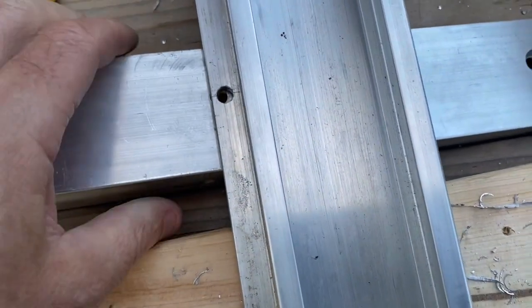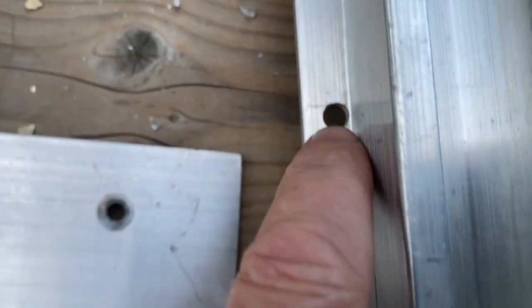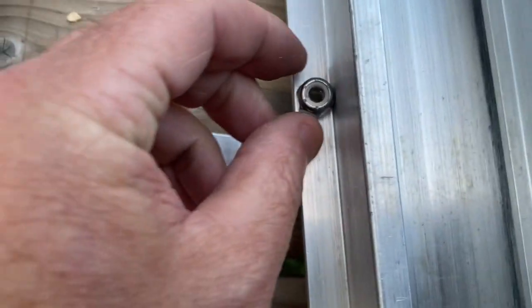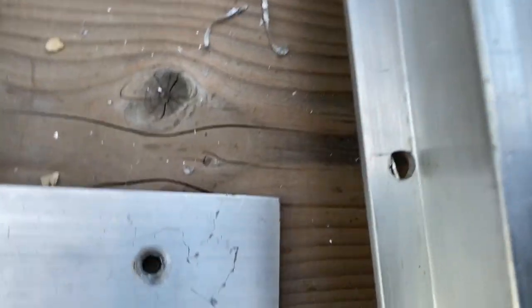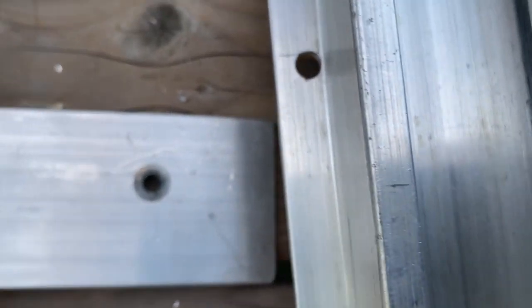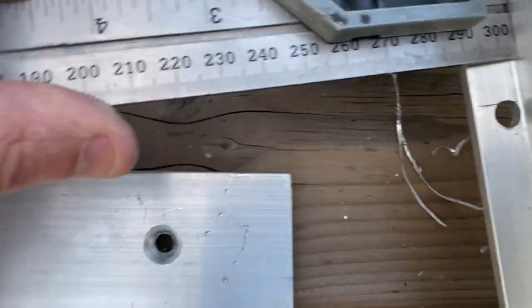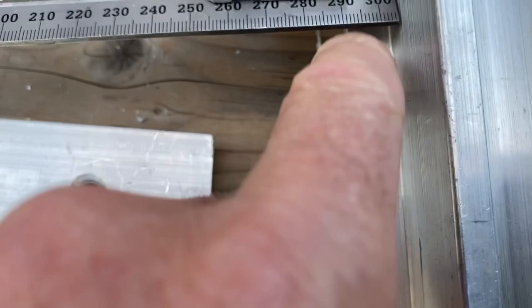I want to show the difference. It's very important to get these holes in the center of this flange. Here's an example I did just for illustration purposes of drilling it in the wrong spot. If I were to try and put the nut on — imagine the screw coming up here — the nut's going to jam against here. You're not going to get that nut on; in fact, you're going to try to ruin it. If that happens to you, don't sweat it — just start over again. Drill it down a little further to give yourself more room. Measure properly, use the square, mark it off nicely on both sides, find the center punch, and start with that 1/8-inch drill. You'll end up with a perfect job just like this one.